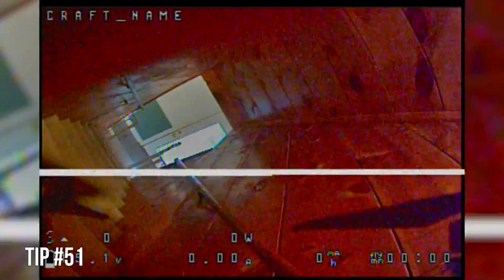If you see interference in your FPV feed that looks like this, basically thin white horizontal lines that sort of dance around, most of the time that is going to be Wi-Fi interfering with you. Yep, 5 gigahertz Wi-Fi overlaps with some of the frequencies that FPV pilots use.